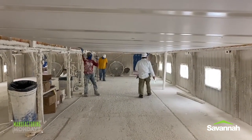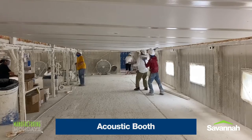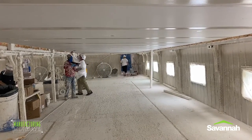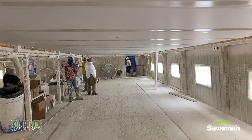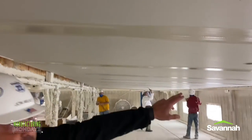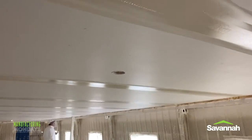So we're in what I like to call the cave area — this is our acoustic booth. What you see right now is they are muddying and taping these ceiling board sections, and they're preparing and sanding it down so they can come back in and spray a vapor barrier on the ceiling. Once they spray the vapor barrier on, they're going to move over and spray in an acoustic finish, which we'll see on this side here. One thing you want to notice is we've already cut out the holes for the lights — the lights are already done, no walls yet.